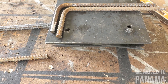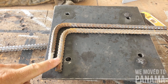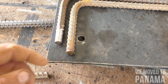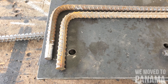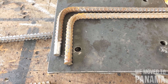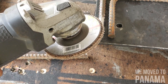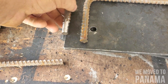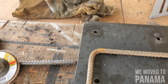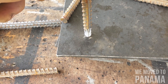For these eight metal plates I used four different types of drill bits to get the size I want — 13 millimeters — where the bar is meant to just slot in. The bar is 12.7mm but unfortunately it doesn't fit in. I went back and looked for a bigger size, 16mm, but they don't sell it. So I have to make a plan using this disc over here and grind it all around the edges — like this one here — to get the roughness off so it fits in nicely, then I'll weld it.